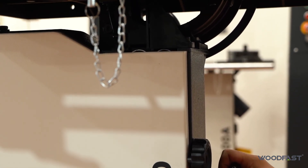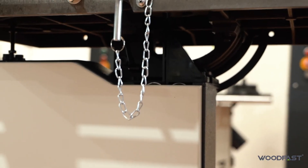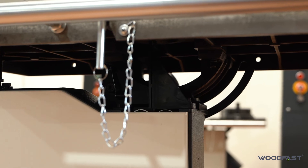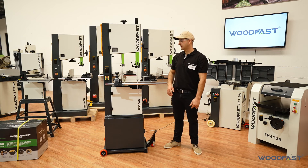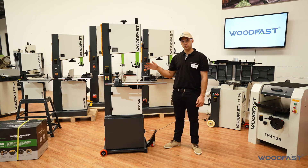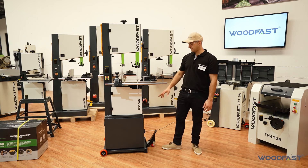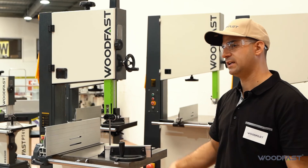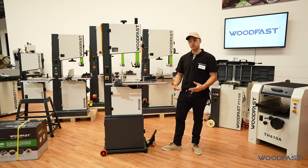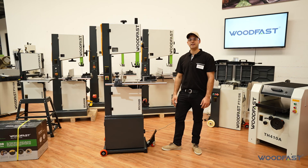You can tweak it a little bit from here, but once you set it correctly it should be fairly right. It is important that you take the time to set your bandsaw up correctly — because if you don't set the blades up correctly it'll give you nothing but grief and you won't be happy with how the machine is performing. You will need to adjust it every time you put a new bandsaw blade on, even if it's the same width and same teeth — all blades are different. We've demonstrated that on this BS350D bandsaw, and the same principle applies to any of the Woodfast range or really any bandsaw on the market. Take your time to set it correctly, learn your machine, and you'll really enjoy it and get the most out of your bandsaw. Thanks for watching — we'll see you again next time.